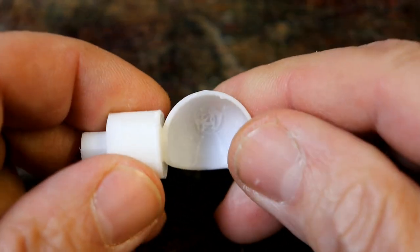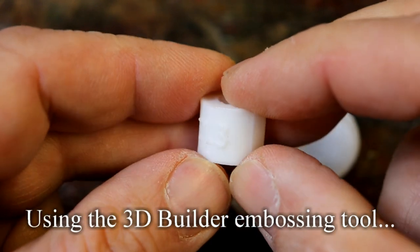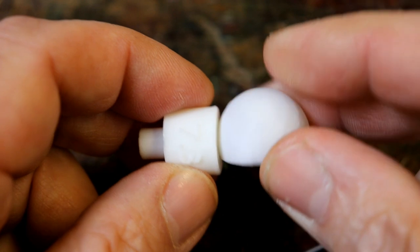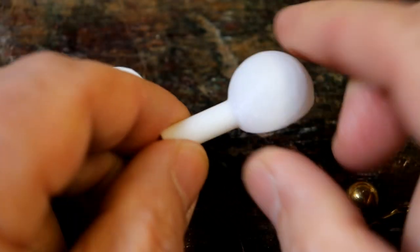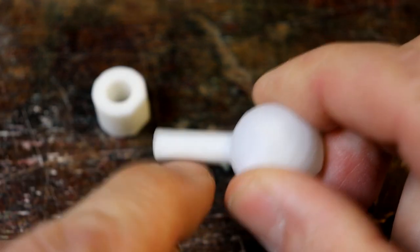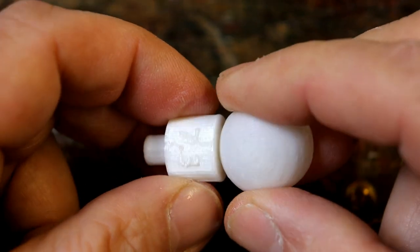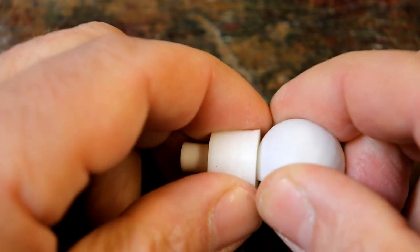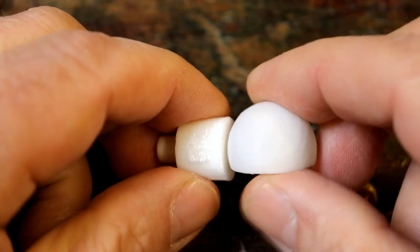The eyelid printed perfectly, it's a millimetre thick, and I was really impressed with that. So I tried printing one, and this one is, as you can see, a 7.3mm diameter hole. The shaft on this is 7mm according to 3D Builder, and this works perfectly. Then I thought I would try, because I printed this one upright, and this one, the eyelid, if it makes any sense, is printed flat like that, so the plastic's going round and round, so it's not going to lend itself, as you can hear, it's quite rough, it's not going to lend itself moving very easily within some sort of support that is also printed like that. But it does, surprisingly. I did try and print one flat, so it was like that, but to be honest with you, there's really very little difference. They do turn really well. So this PLA plastic is very low friction, that's perfect.